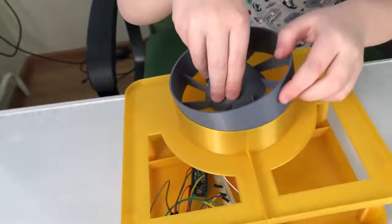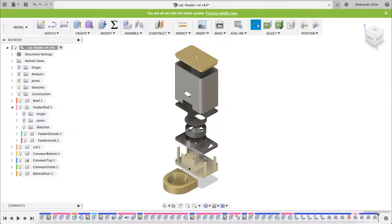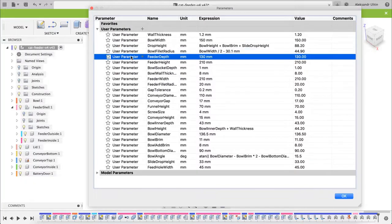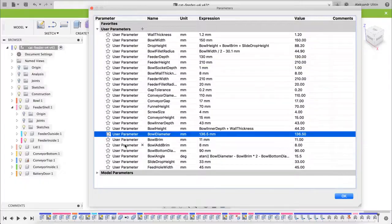This is the guide on how you can build one yourself. You can get the STLs and the Fusion 360 files at the link in the description. The design is parametric, so you can change the size of the feeder or the bowl in the parameters menu.